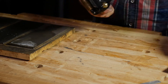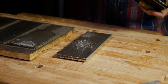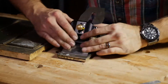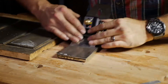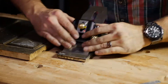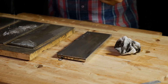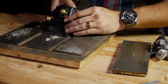I'm going to turn this now to the six o'clock position, which raises it up a little bit higher to add a secondary bevel. I've now established the secondary bevel all the way across the edge. I'm going to move up through the grits now, moving on to the fine diamond stone on the secondary bevel setting, just removing the scratch patterns from the coarse diamond stone.